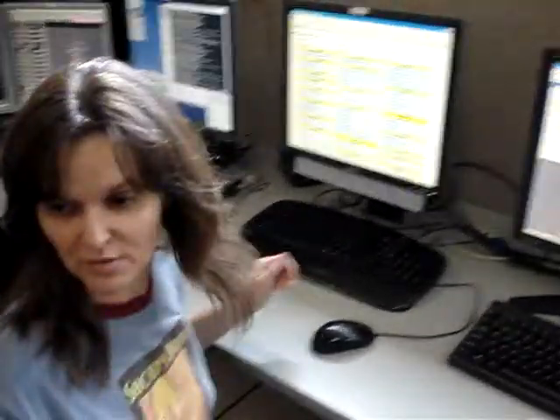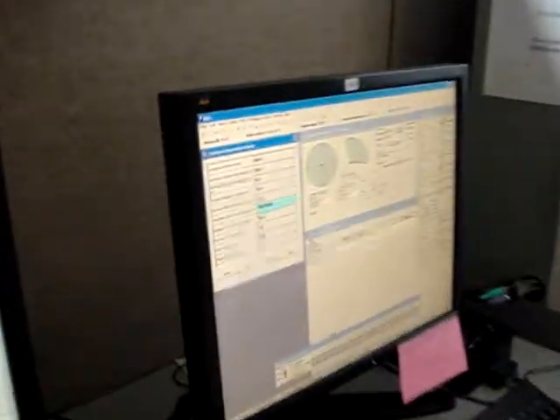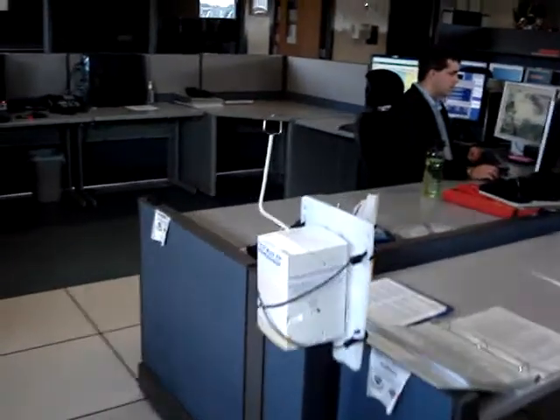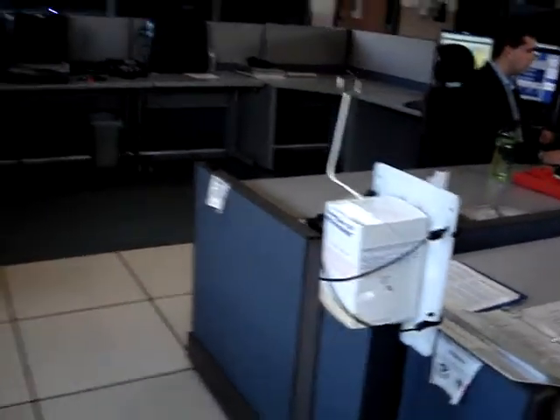So now the battery is in. You want to stand over here, because you're blocking the signal. Here's the signal strength right here — it's about 70-ish, and that's what you want. Once the battery is plugged into the sonde, that's the signal strength you're looking for. Now we wait five minutes for it to power up.